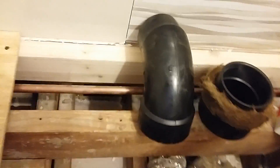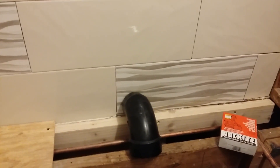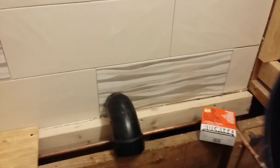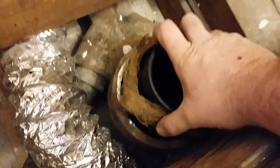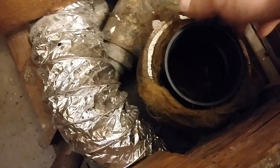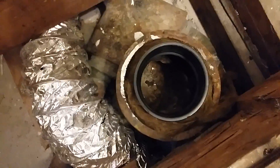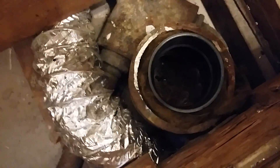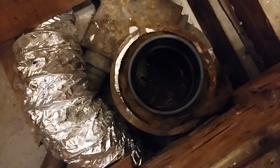What I'm going to do is take a four-inch base to a three-inch hub adapter and go ahead and insert that down in here. Once I do that, I'm going to stuff oakum down in here around the sides — that's expansion fiber used in cast iron plumbing, usually with lead poured over it, but we're not going to need the lead since we're going to PVC.